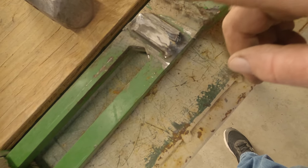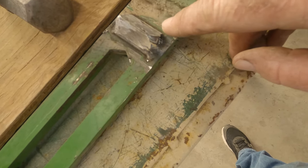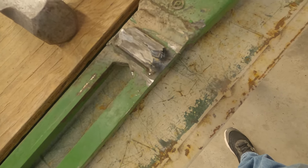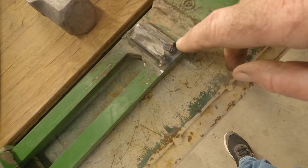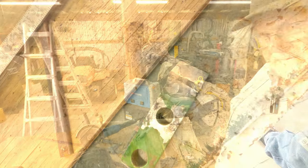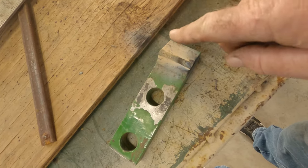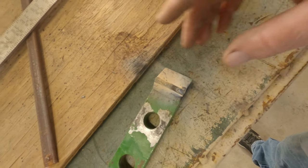Most of it rides here and not over here. It looks like maybe they welded it and it wasn't a very good weld, and I knocked it off whenever I was hitting it. So I'm going to weld that back in. You see this weld right across here? I'm just going to sharpen this up and call it done — I think that's going to be all that this needs.